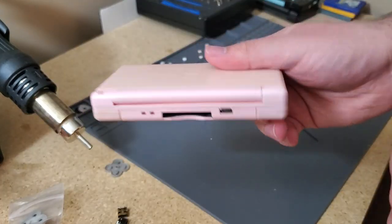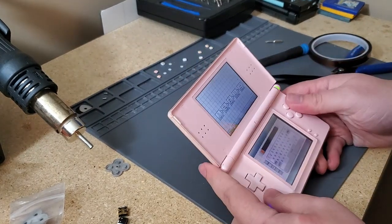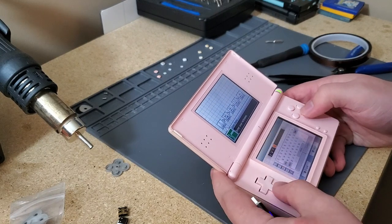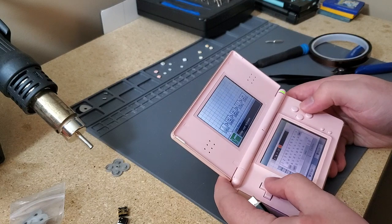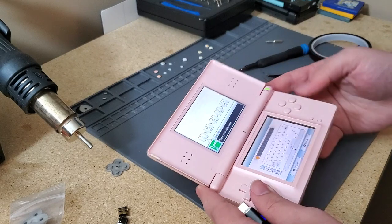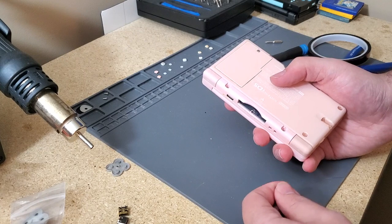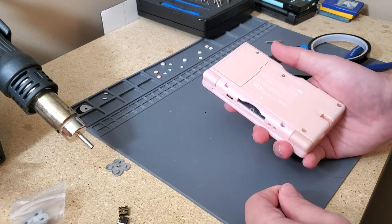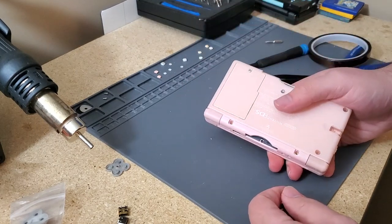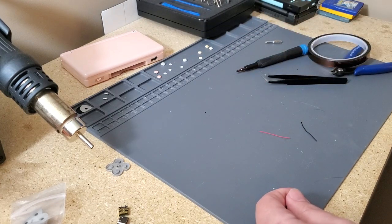With that, that's how I add the USB-C in. You know, pretty easy. Well, easy enough once you get the wires on to the connector. Doesn't really take a lot of work other than that. It's pretty standard, just swapping. Other than that, oh, I did forget to solder down the other two legs, but it's not too big of a deal. I mean, two is good enough, but if you drop it real good, it always helps to have all four. But they're all connected anyway to that outer metal.